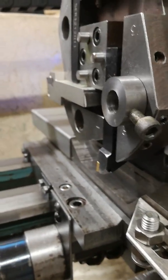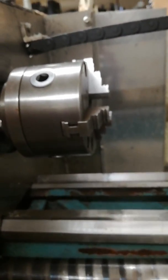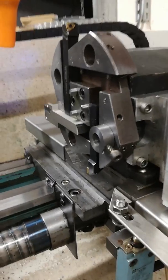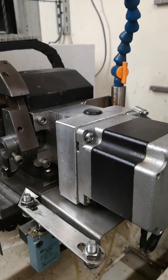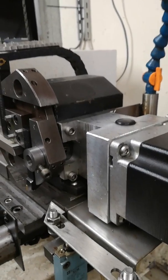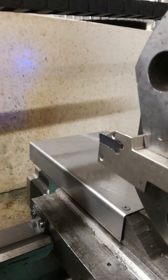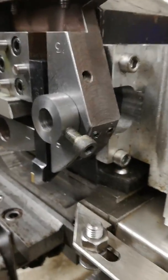Anything limiting this machine now is possibly the spindle bearings, and I might try and put a stronger or higher quality set of bearings in. But the machine's been great, I've done a lot of work on it. The tool turret's great now - I've put a stepper on it instead of the god-awful DC motor with the reduction gearing which dies. It's a direct drive onto the worm inside the turret, and I've constructed stainless steel slides to come at the front and rear of the x-axis slideways.